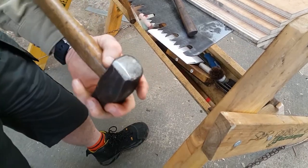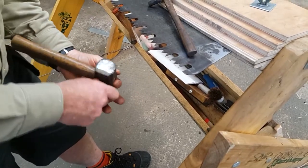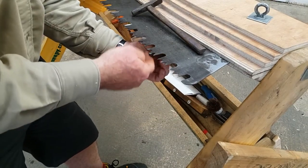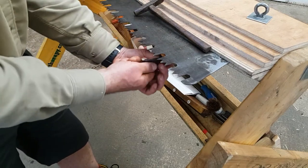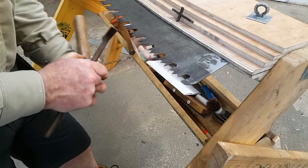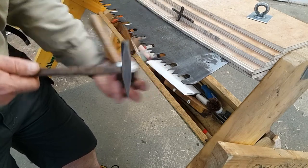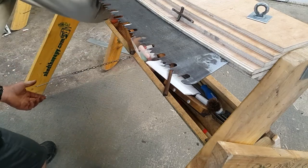Just because I want you to experiment — imagine you only had a hammer like that as your anvil. In the event you set a tooth too far, the saw spider will rock in this axis. In that case, what I do is put the anvil underneath it like that and hit about three or four millimeters back from the tip of the tooth to flatten it. You can try doing that as well. That's good.